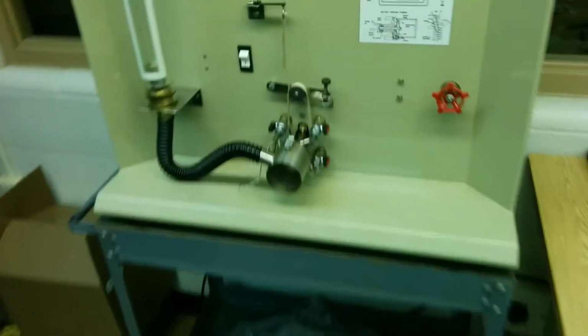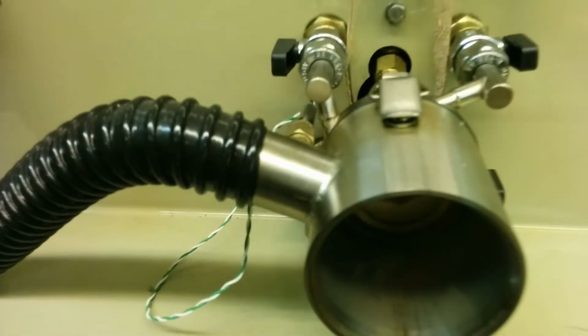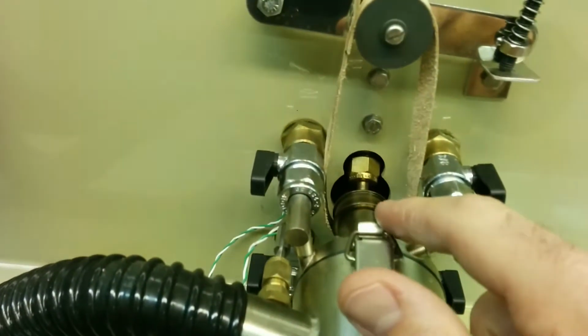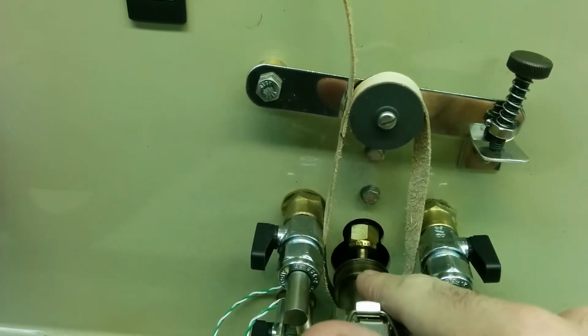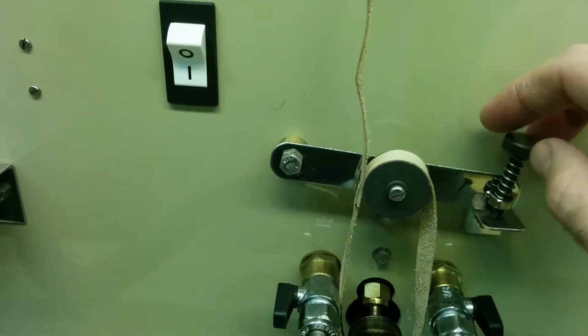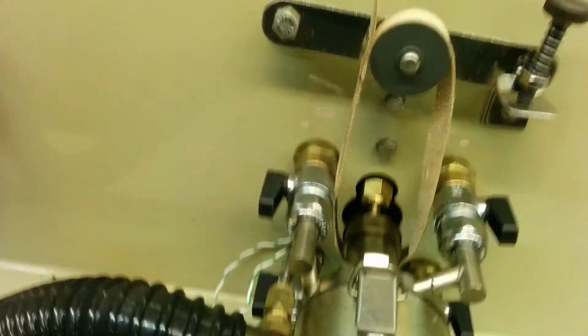This is a small turbine inside this encasement. The turbine runs on compressed air blowing through these nozzles onto the turbine. The turbine itself, the armature, comes out to this point where a leather strap is placed around the armature and around this lever system, in which you turn a screw here in order to tighten a strap to impose a force on the turbine armature.